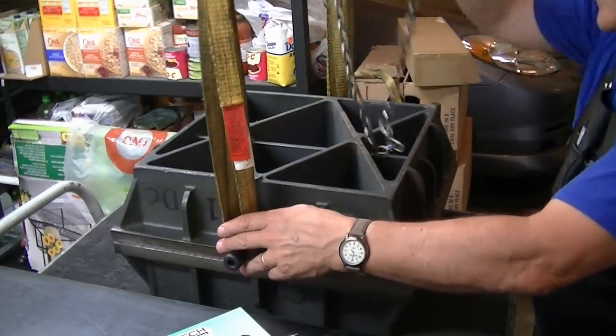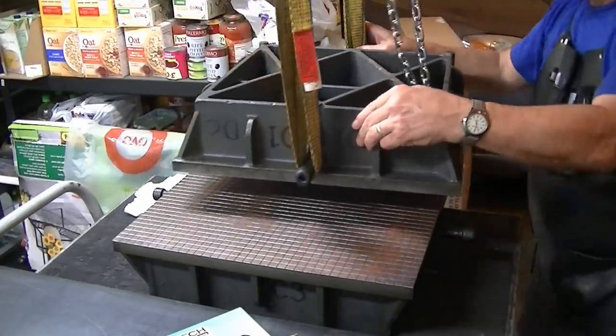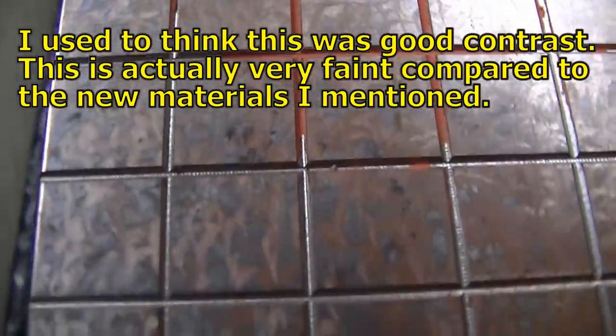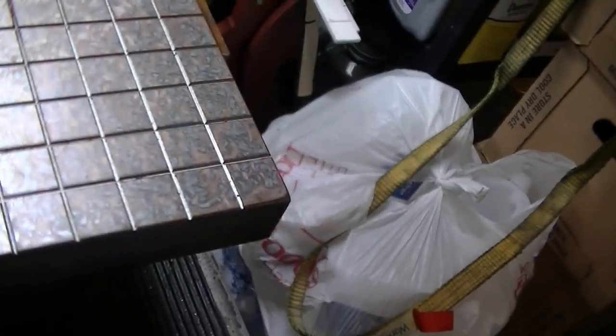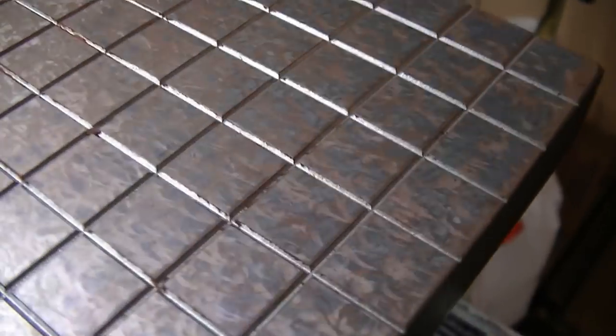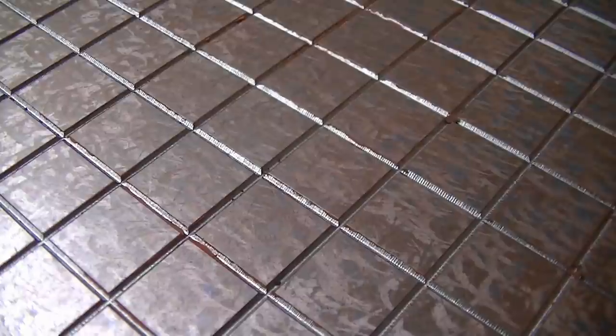See what we got. Here's what a pretty nice bearing looks like, and a nice rub. We've got a nice contrast between the orange background and the blue. Good identification of the high spots. And over here, we can see the same thing, but it dwindles out and it's not touching here at the center at all. So it is concave as we suspected.